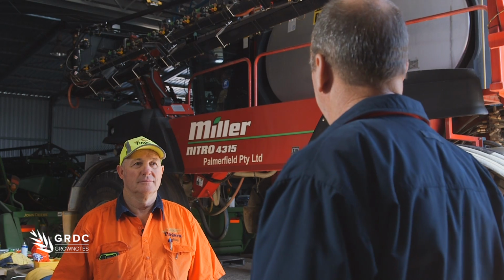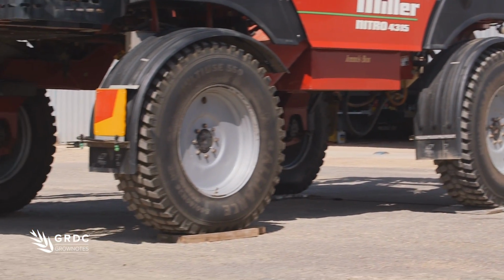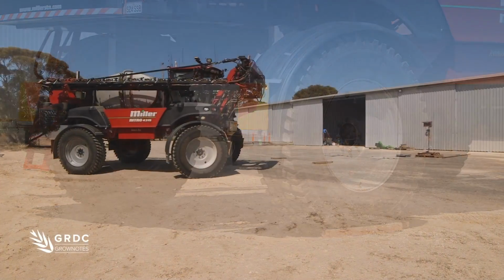Right, that's a damn lot. So it's a lot of pressure. So what are you going to do about pressure? Now what we've done is we've pumped them up so that they actually look the same, and we've got 30 psi difference between two tyres just to get them to where they actually should be for the load that they're carrying. And does the shape of the tyre look a lot better now? Oh, all four tyres now look as though they're pumped to the same pressure, although 2 of them are 30 psi different.